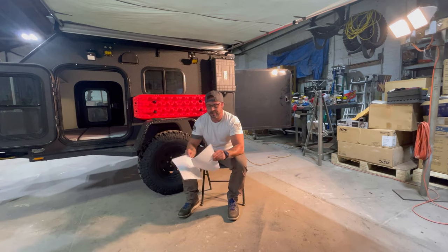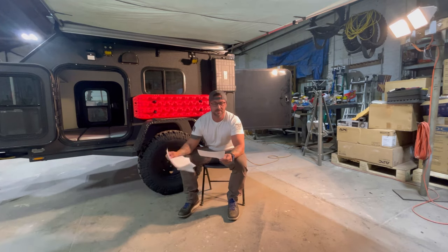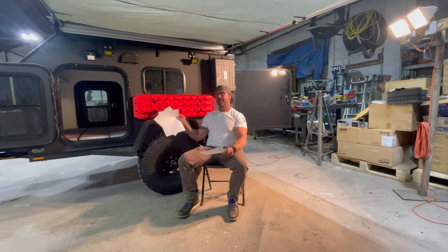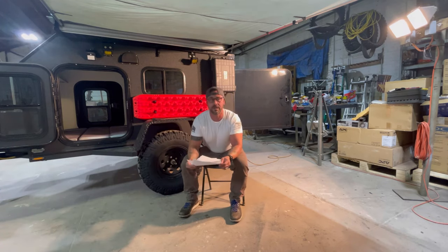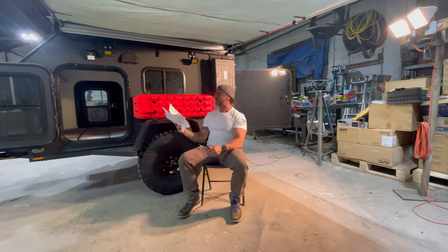Let me find it, guys. These are the important things. They use poly wall liner, Tiger Seal, Seam Seal, and 3M 5200 adhesive, stainless steel, all hardware and bolts. It's an HDPE material. It's a sandwich construction floor with the HDPE and that fiberglass marine flooring. That's what I was talking about. They cut no corners on the construction of this as far as that goes.